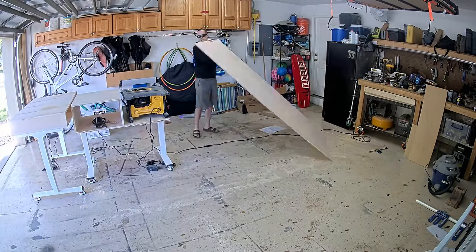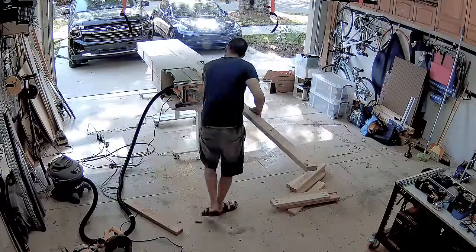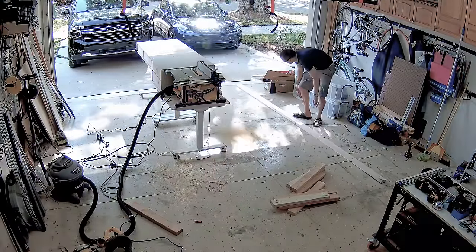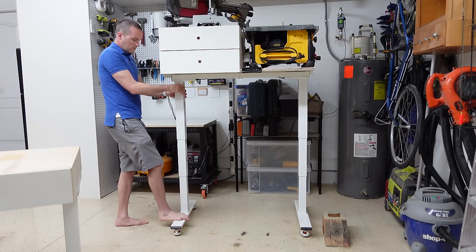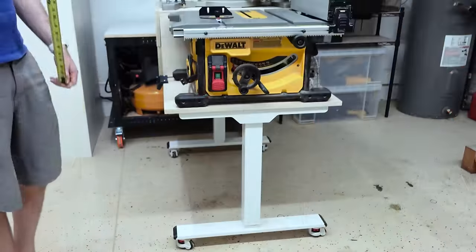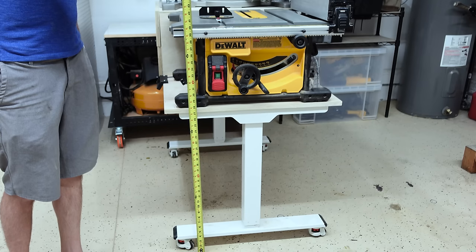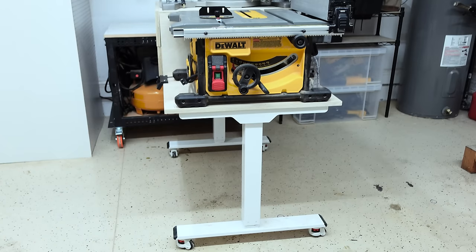In order for the table saw section to work safely, the structure needed to be sturdy enough to rip sheet goods without tipping over, and so far it performs significantly better than the mobile stand from DeWalt and even better than my previous table saw that had a built-in stand. Ripping sheet goods is surprisingly simple, and I was even able to clean up the edges of a 12-foot 2x4 without it falling off the back of the table. At maximum height and loaded up, the FlexiSpot frames can get a little bit shaky when you roll them around, but at minimum height they are super solid with basically zero flex or wobble. With the E7 at its lowest setting, plus my leveling casters and a single sheet of 3/4-inch plywood, the top of the table saw is right at 40.5 inches — just about the perfect working height for someone my size. In hindsight I probably could have used a fixed base on this section, which would have saved some money.